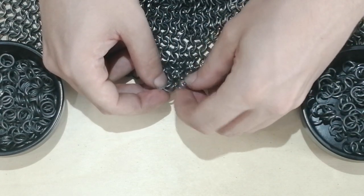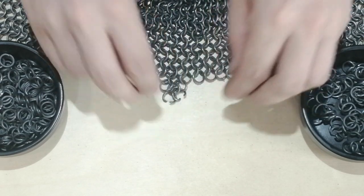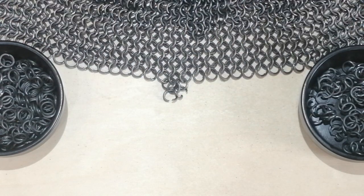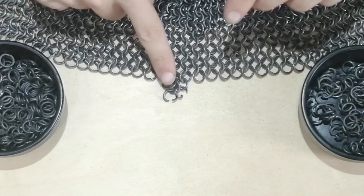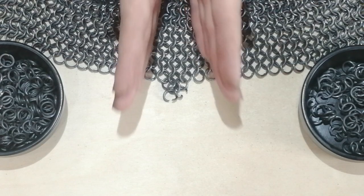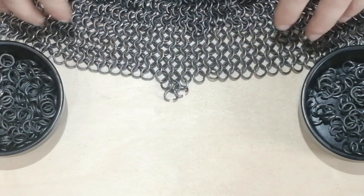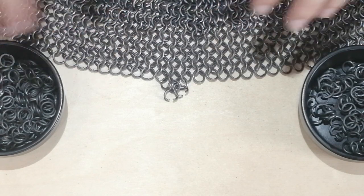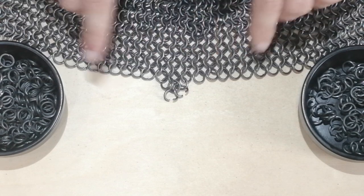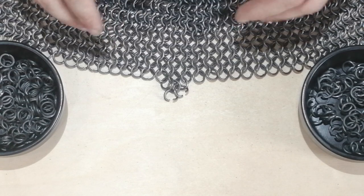What this does is it, in effect, now makes a triangular section. This bit is straight — it forms that way. When you get to the expansion, it curves off like that, so you end up with a triangular addition. What I usually do is I divide the length of the piece I have into, say, 12, so that I have 12 expansions. That will create a piece that eventually will become a circle.